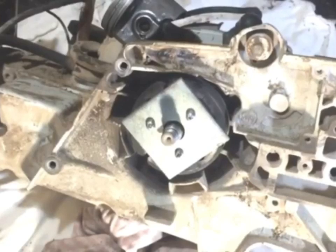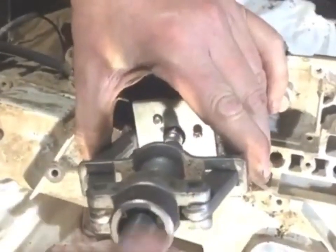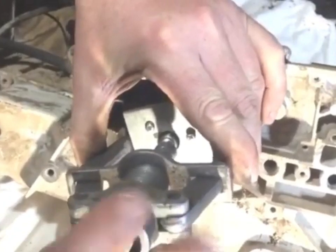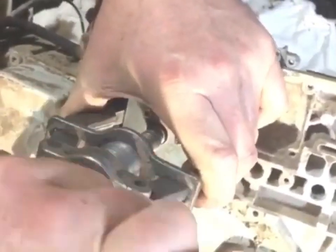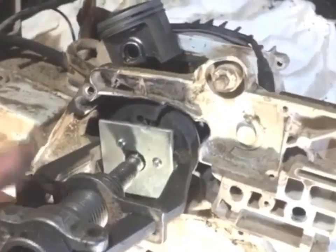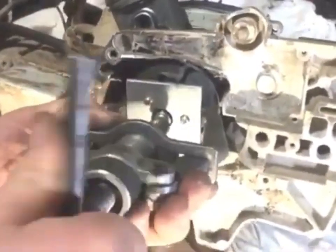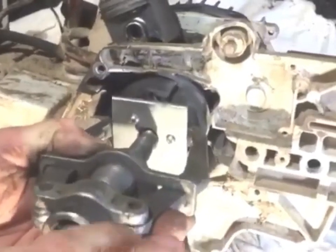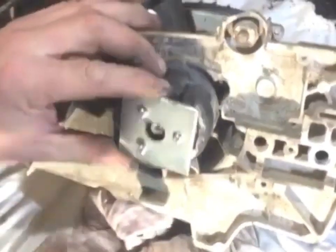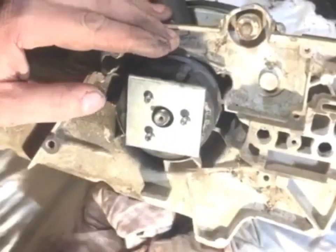You do need a puller, but this is my two-jaw puller. Just take the strain a little bit off there. Right, now I've got that on center and the strain's been taken up. And see, it's pulling off — it's a little bit fiddly to get it right with the puller, but has that pulled off tightly? Yep, it's off! So that's how I did it. You do need a two-jaw puller — that's mine, but anyone will sort of do it as long as it's wide enough to get over your washer.